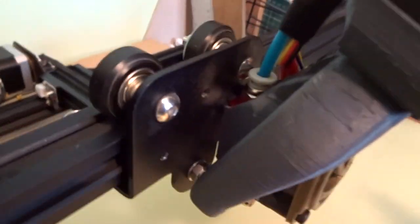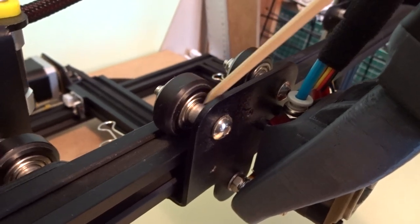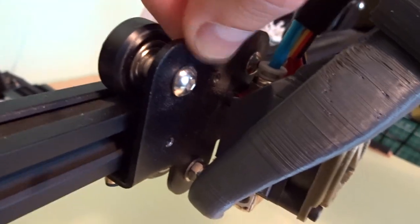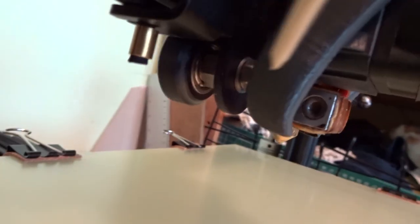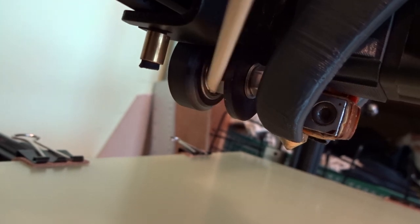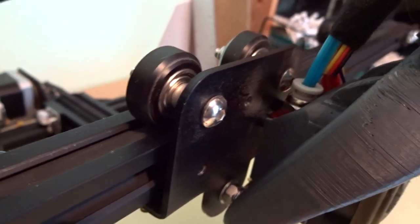The hot end is mounted on the carriage plate. These are the rollers and bearings — they all have to be adjusted so there's absolutely no wiggle or play, since you're printing at very high tolerances. Underneath you can see there's an eccentric nut — a nut with an off-center hole. As you turn this nut it raises the pulley up and down, putting pressure onto the carriage plate and giving you complete control over roller pressure for nice smooth operation.